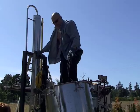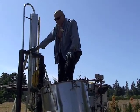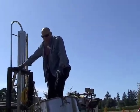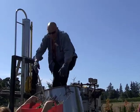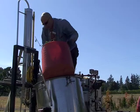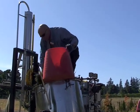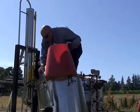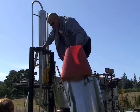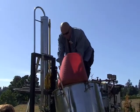In this still, there's no water in the retort — it's purely steam. I'm just going to introduce steam from my boiler. I have an eight horsepower low pressure steam generator. When I turn on the steam, it's a low pressure steam generator, and I bring it into the distiller at about a half a pound pressure.